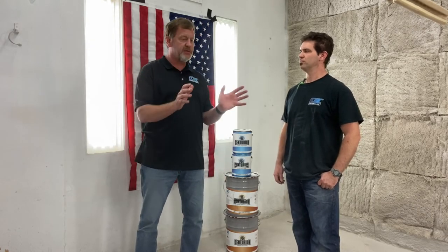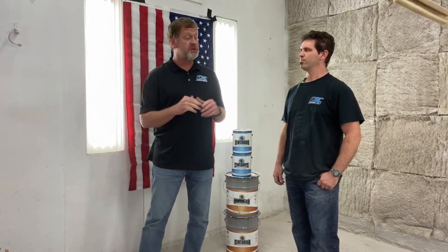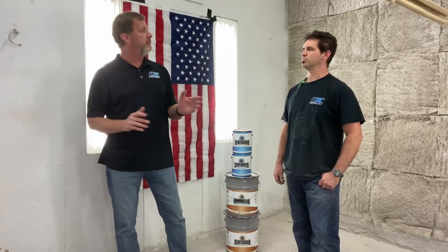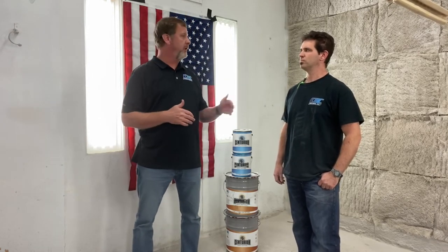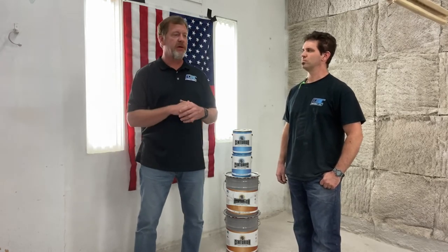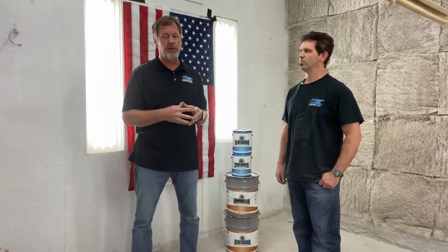Some people have found with our products, they love the Crosslinker, and in their specific application, it works well, and other people have found the hardener. I would suggest that you do your own testing. Do ladders. Go from 5% to 20% and in between. And on the Crosslinker, go to 1% to 3%. And then spray panels. Come back a week later, take your acetone, take your coffee, take your nickel test, and see what the benefits are. You can really expand these products with these two different additives, but you have to determine what works best for you. And like always, you always want to test, but you can really do some neat things.